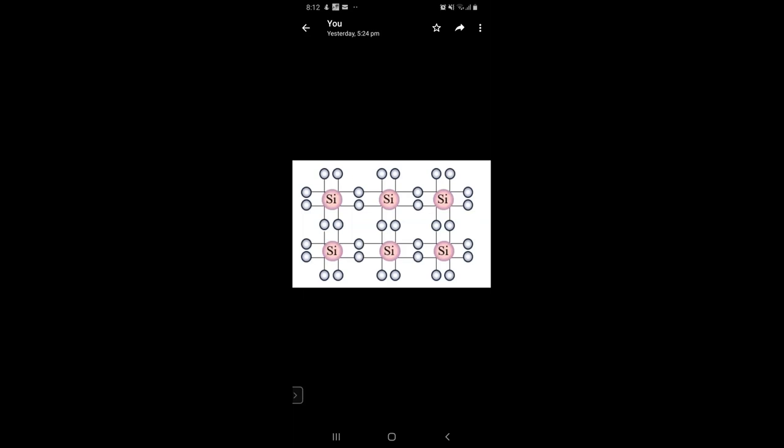At lower temperatures, it will behave just like diamond, just like carbon: each atom bonded to four other atoms, simple. But at higher temperatures, one of its electrons will get free of the bond. How many per atom, I don't remember right now, but yes, a few electrons get free, and as they are free, they are available for conduction. That makes this a semiconductor, meaning that it is conducting at higher temperatures, but not conducting at lower temperatures.